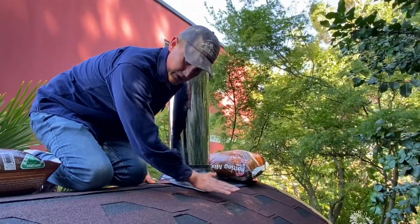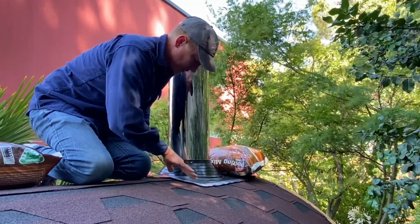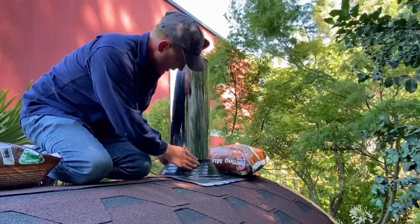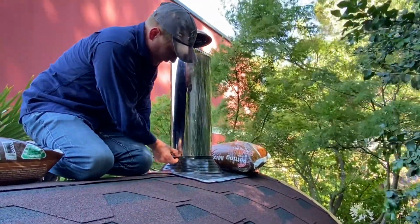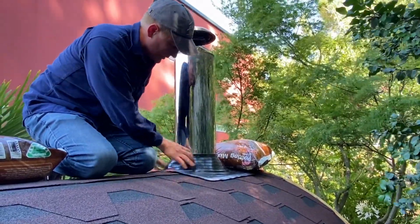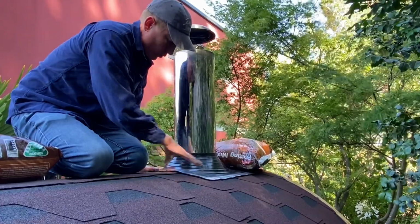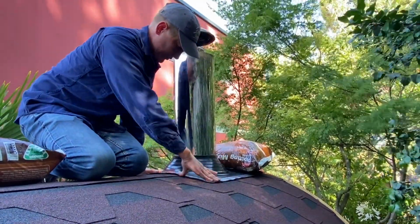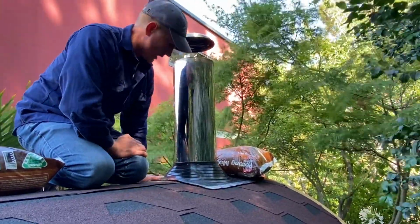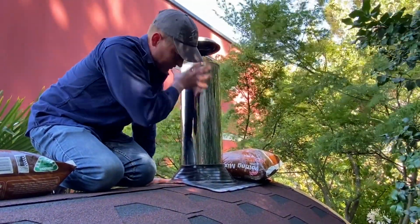And when you guys have finished with the tiles, and all tiles are completed, to seal the flue, you should be able to find a seal in your kit, and it will look like so. And if needed, you cut out the required slits, like these, to adjust to the right size of the flue. Slip it over, and you can glue it onto silicone or use some weather screws. It's up to you what you use, as long as it sits tight, and that will protect the interior from the rainwater and the smoke if there's a draft of smoke coming down.